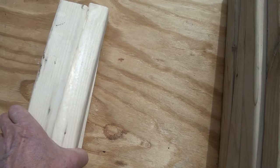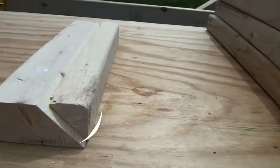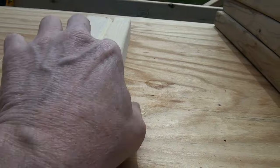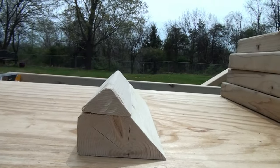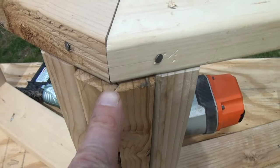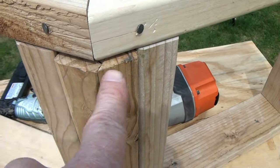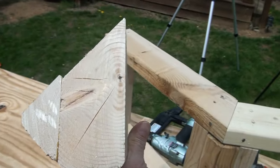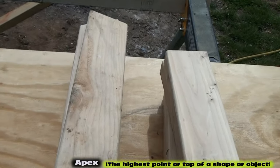You can see there are two pieces here. This was originally just a chunk of two by four that I cut a 45 degree angle on. When I cut it 45 degrees, I take the cut rip piece — the smaller of the two — and I just slide that right up on top of the other piece. So you end up with something that looks like a wedge. That wedge on our model gets inserted right there, right between the stud on the end of the wall and this stud. There's going to be a big void in the middle, and that's where you insert this piece. The little rip on top forms like a triangle, and that triangle gets inserted right in there at the apex.